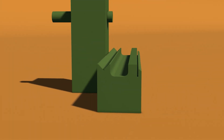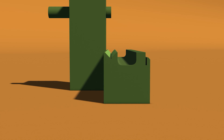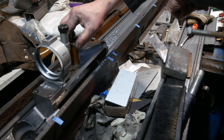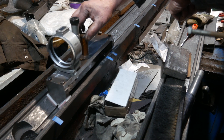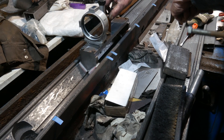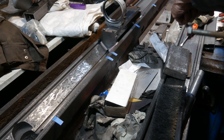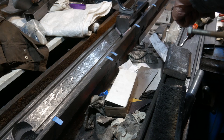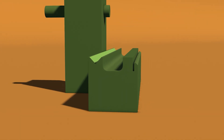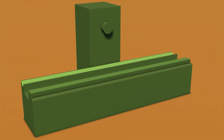The first thing to understand is that I now have what I consider a conditionally perfect, straight V-shaped prism for this situation. I'll make a separate video showing how I take measurements with a 0.2 arc-second autocollimator on this V-shaped prism, using a 300mm mirror stand. This video will confirm the validity of my geometry data. For now, just take it for granted, based on my statement, that it's straight with a tolerance of no more than 5 microns.